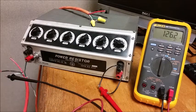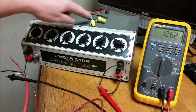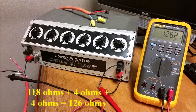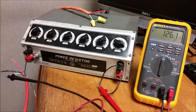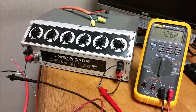Okay, so we've simulated approximately 8 ohms of resistance now. This would be accurate for 120 ohm resistor over 1,000 foot of cable at 16 gauge. Which your first thought is, wait, the chart said it's only 4.27, 4.3 ohms of resistance for 1,000 foot of cable of 16 gauge. This is true, but don't forget, you're going down 1,000 foot and coming back 1,000 foot. So you're at 2,000, giving us an additional 8 ohms of resistance, roughly, for this simulator purpose. That's what I wanted to point out to you.